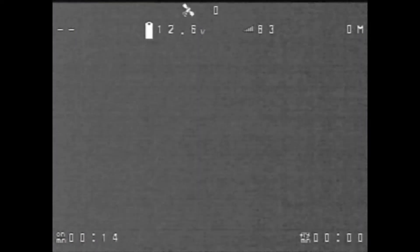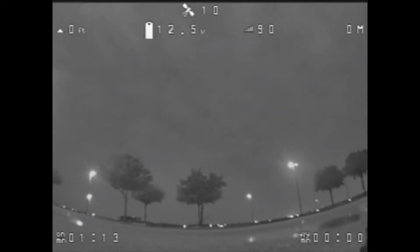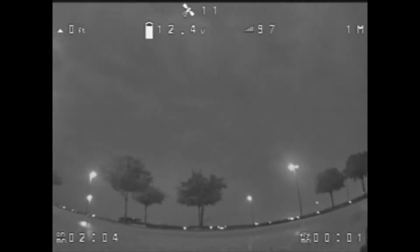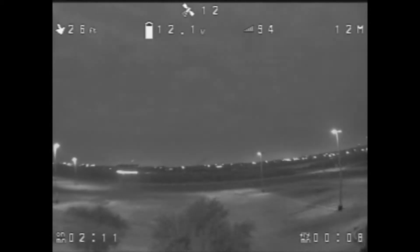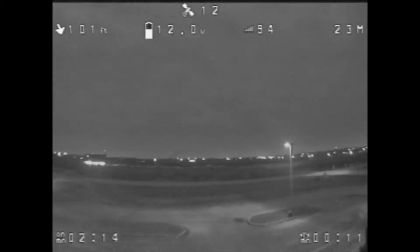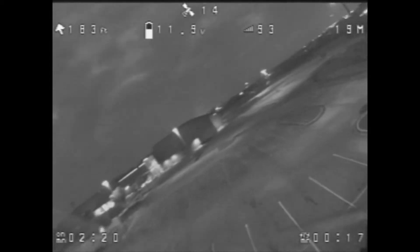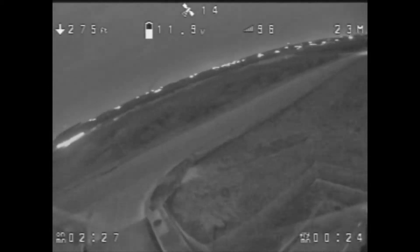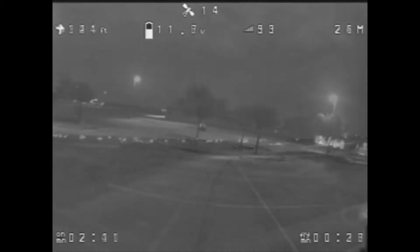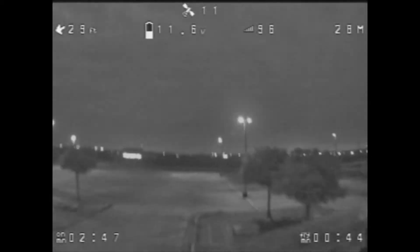The first thing we tested was exactly how long it took to acquire GPS satellites. I've got Betaflight set to allow takeoff at six satellites — it took about 45 seconds to get six. It then popped up to 11 satellites right around one minute and fifteen seconds. That is much faster on a cold start than the other big GPS puck. So this is a better, higher-quality puck — it's lighter and about five dollars more expensive than the bigger one.